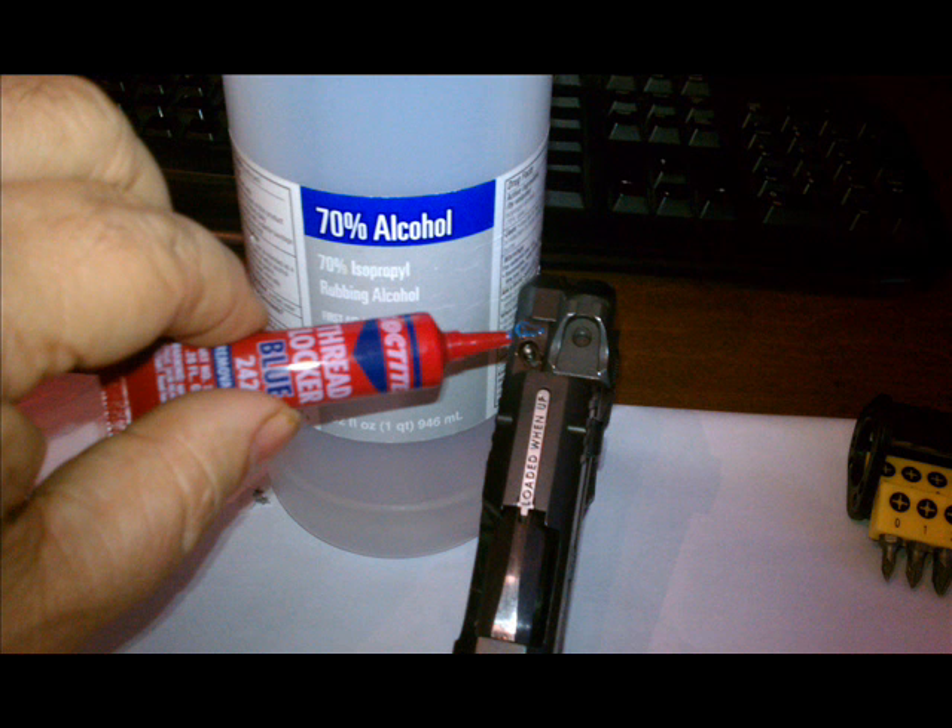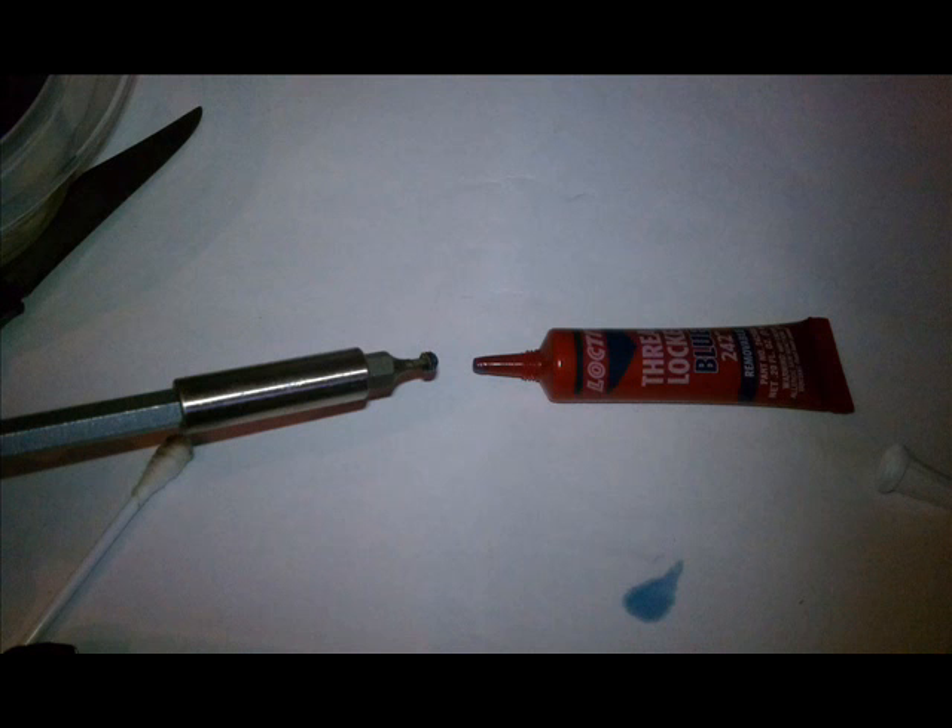This is another picture where I put a little dab of Loctite on the mating surfaces — way too much here, so I scraped most of it off. Put a little bit on each edge. Now this is blue Loctite, not red. Blue is key — you want something removable that you can disassemble. Red is more permanent and is meant to permanently lock parts together. Then put just a dab of Loctite on the threads of the set screw as well.